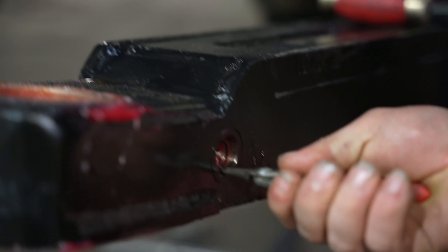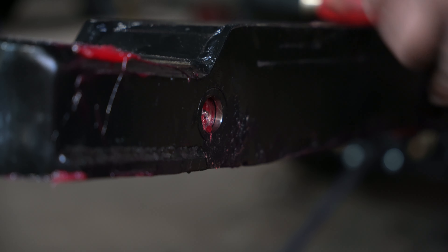Next step, you're going to take out the front stinger pin. Take off the snap ring that holds it in and then set that to the side. Take your punch. Always try to use a brass hammer and brass punch on all the pins — that way you don't mushroom them or damage them.